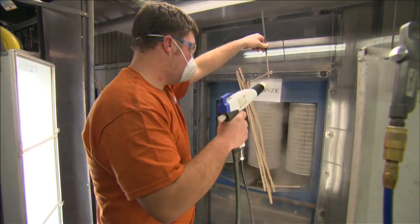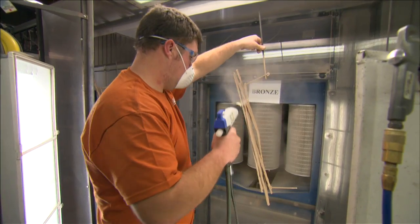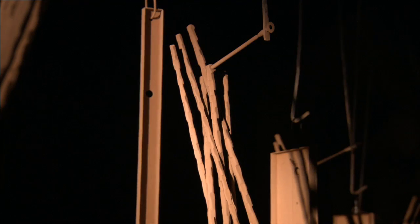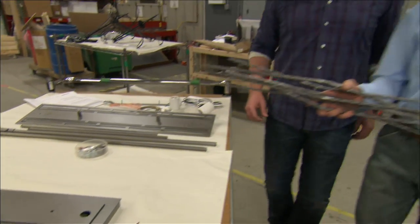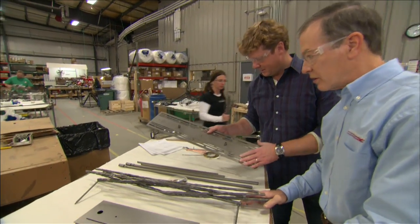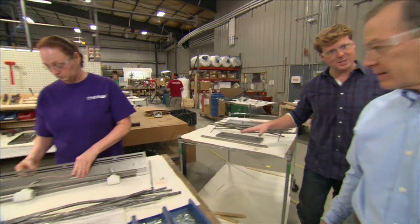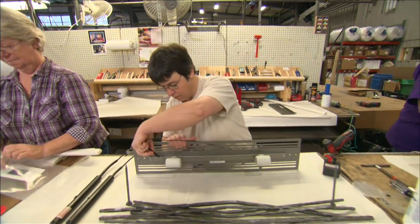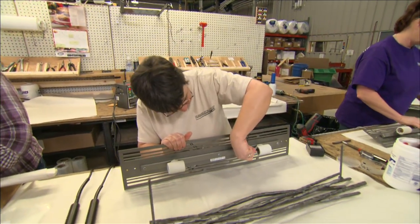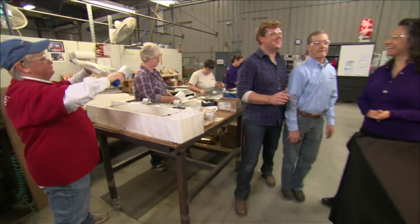In the powder coat room, a negatively charged paint cloud is sprayed onto the grounded steel part — the two are attracted and the paint sticks. It then goes through a convection oven for 20 minutes at 380 degrees, where the paint particles are cross-linked, creating a very durable finish that's translucent, allowing you to see both the texture and the color through the paint. The twigs are then married with identically finished components, all finished on-site to keep the look consistent. Electrical components — including a double socket and grounding — are added, continuity and high voltage are checked for safety, then the fixture is packed for shipping.